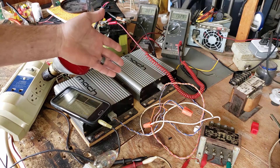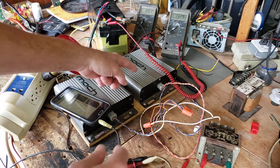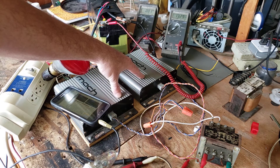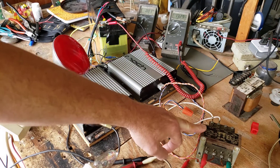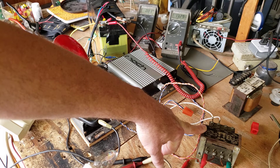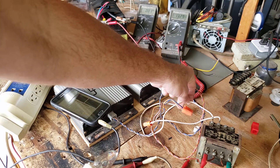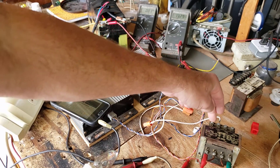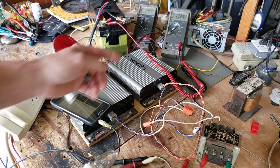So what I did was to make it a split phase inverter — all you have to do is step the voltage up. The voltage coming out of these guys at max is about 20 volts. So I run it through this transformer here — this is a 110 volt to 460 step-down transformer, but I'm feeding the 20 volts through the low side and coming out the high side with the voltage that I want.